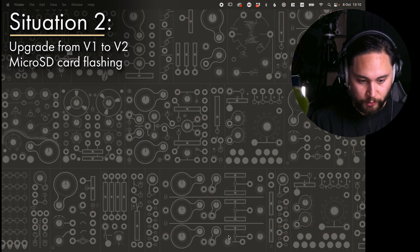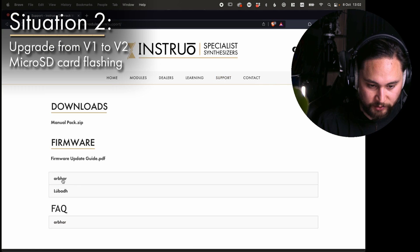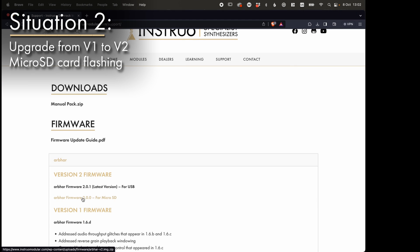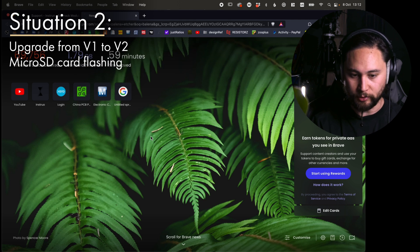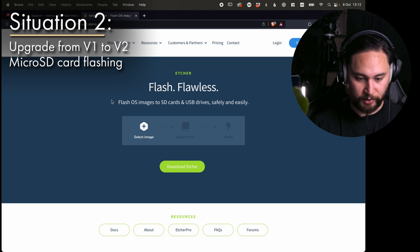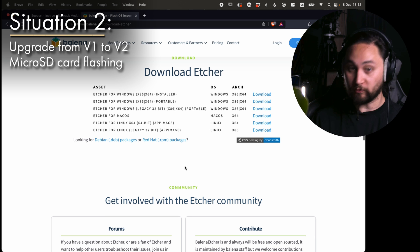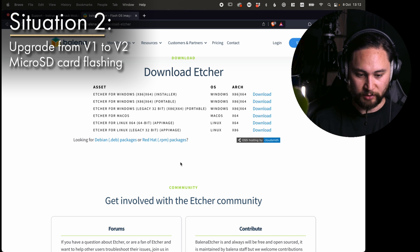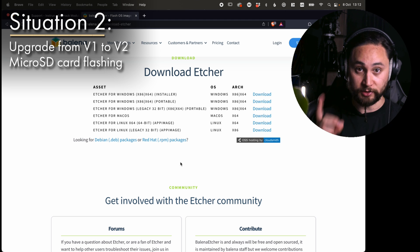Over on your computer, go to the support page, Arbor, and download the latest version which specifies for micro SD. I recommend using a free program called Balena Etcher, which is cross-platform and pretty easy to use — download and install that. Etcher is going to be used for flashing the image to the micro SD card. This is akin to burning a CD-ROM. It's not as simple as a basic file transfer — it needs to be burned on bit by bit. Etcher does that very efficiently.